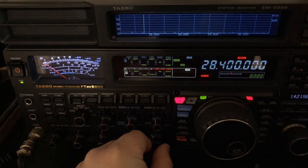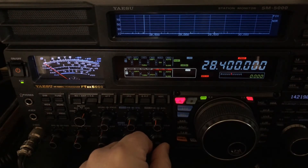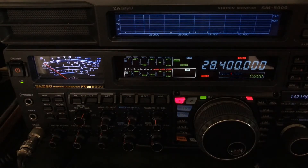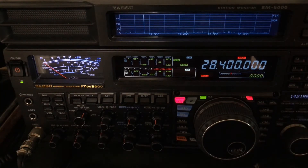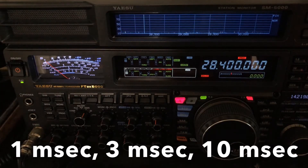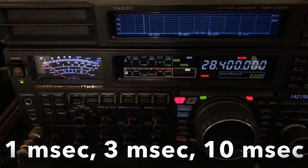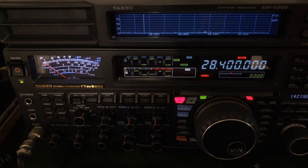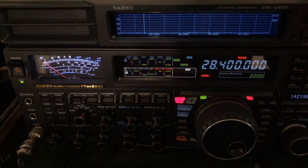Regular noise blanker. Wide mode. I'm not going to go into the menu because I did it in a dedicated video all about wide mode. But there are some tweaks you can do in the menu to adjust how many milliseconds wide you want the wide mode to look. On many of the radios today you've got three choices — like 3 milliseconds, 10 milliseconds, 30 milliseconds, something like that. And then you've got three choices on how deep or how hard the rejection should be. On this radio it's on a scale of 0 to 100, and you can zero right in on exactly the width you need and exactly how much rejection — they call it level.